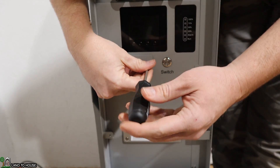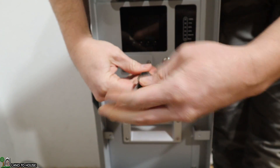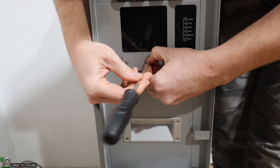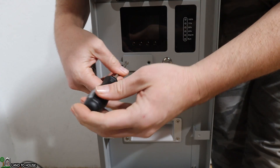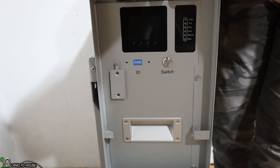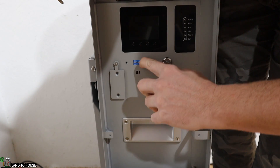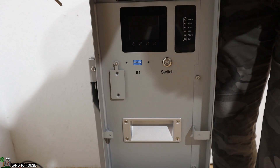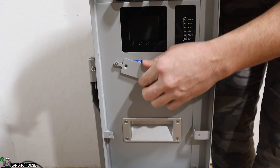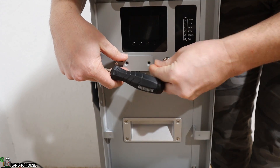I'm going to turn the battery off and open up that ID port. The ID bits are primarily for whenever you have multiple batteries lined up. We're going to be using just one battery, so I may put it into position one. You can see all these little dip switches in here — I'm going to push this one dip switch for position number one. As long as you only have one battery it doesn't really matter, but this is how you'd set it.